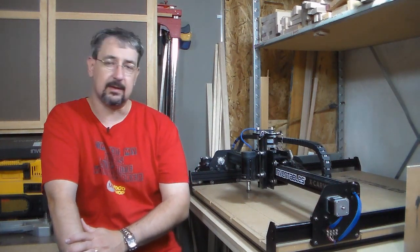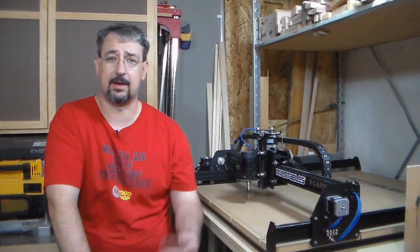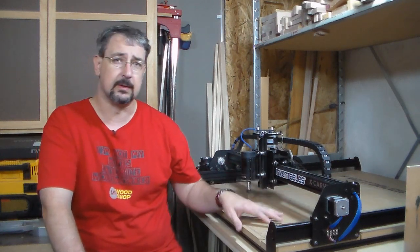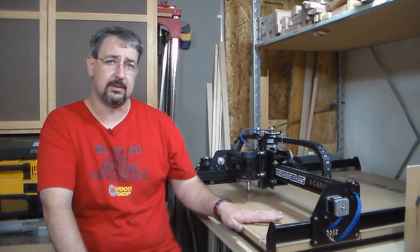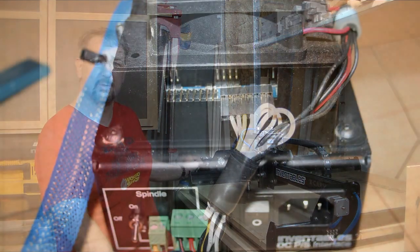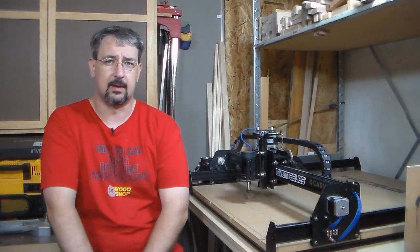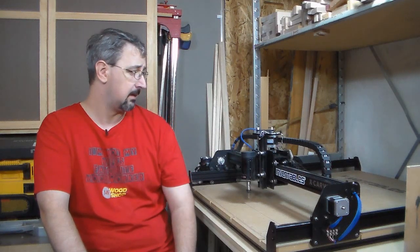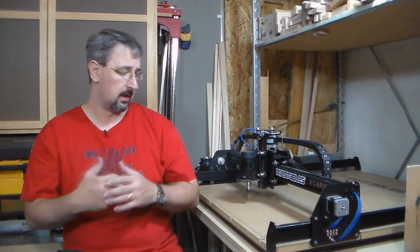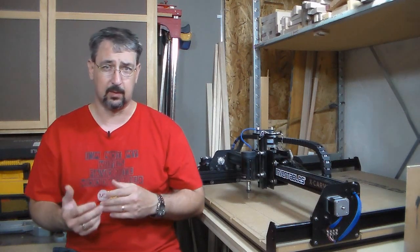The instructions have embedded YouTube videos that I almost strictly went by. Very little that I actually had to read the text to find out what to do or how to do it. The only time I got tripped up was with the limit switches — I didn't understand how they got hooked to the Arduino board or the G-shield. So I had to actually read, watch the videos, and for the most part take a wild guess. I think a little improvement there. Overall, I'm actually pretty impressed with the machine and the way it cuts — a little slow for my taste, but I think a bigger, heavier spindle will correct that problem.